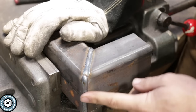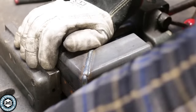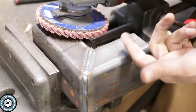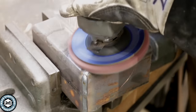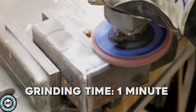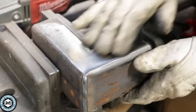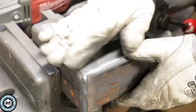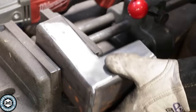Here's a typical flat weld on a piece of tubing. I've got an outside corner and a flat weld that was beveled before I welded it, so there's not too much sticking up. This is done with a MIG welder, not a TIG welder. I want to show you how using one of these grinding and finishing discs, I could take this thing down and not leave too many big scratch marks that I'm going to have to blend out later before this goes out for paint. Look at that — in just a matter of seconds, I'm able to take that weld down. It's perfectly blended, very flat, and I was also able to polish out this corner. You just can't do this with a regular flap disc without leaving tons of scratches. For comparison, I'm going to do the other side with just a regular grinding disc so you can see the difference between the two.